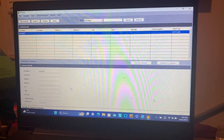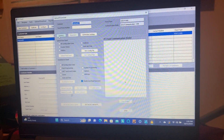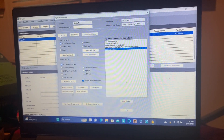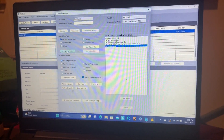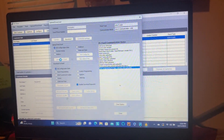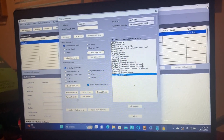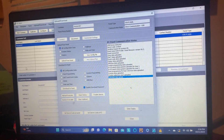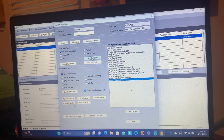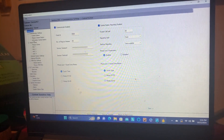I have opened PS Tools and now we're going to plug in our cable into the computer — cable's already connected to the panel. We're going to go to Upload/Download and go ahead and connect the panel, then upload the current configuration file. That'll take about a minute. Okay, the new configuration file is now uploaded, and now we're going to go over to View Config File to pull up the configuration file that was uploaded from the panel.